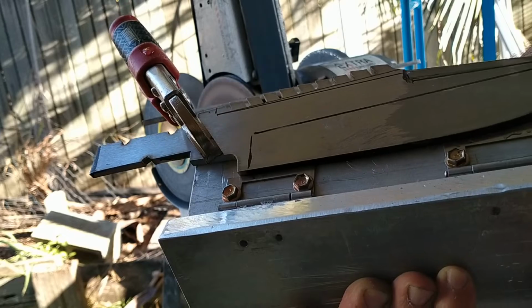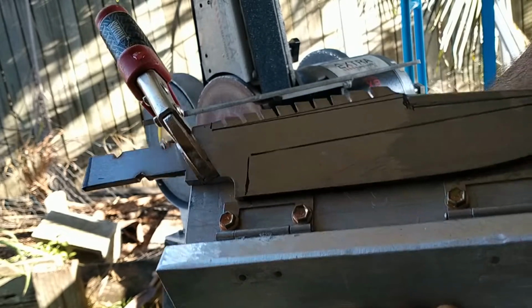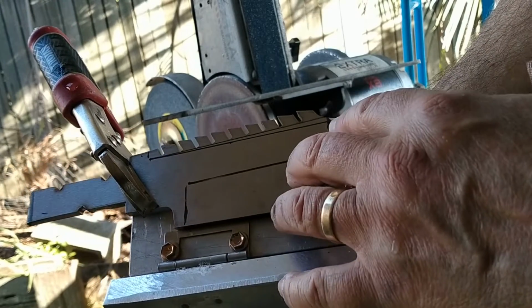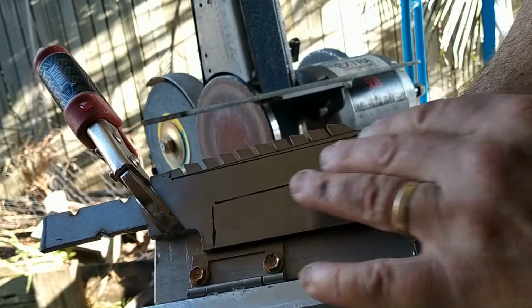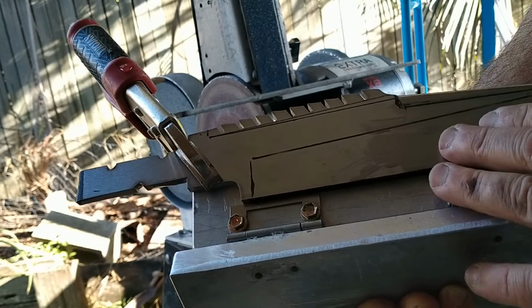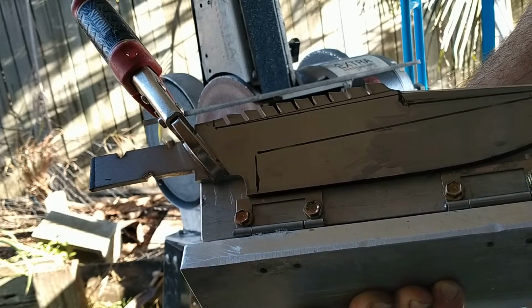So there's two things you've got to watch with this. Is if you push too much pressure, it'll grind more at the edges, not the middle. So it's a case of let the belt do the chewing, and I just got to hold even pressure, work back and forward, until I reach my desired depth line. Hope it's of use, and thanks for watching.